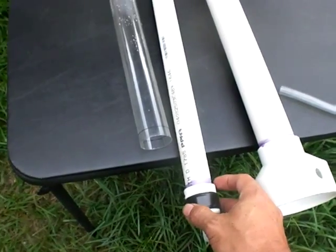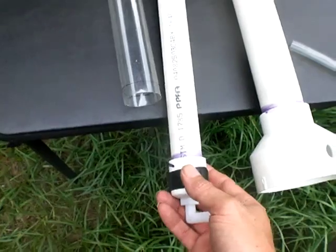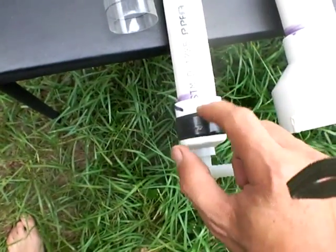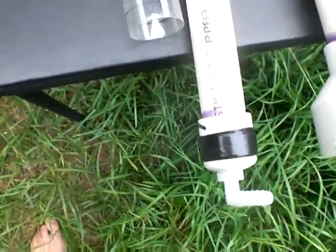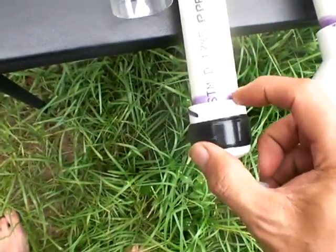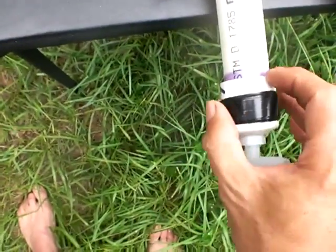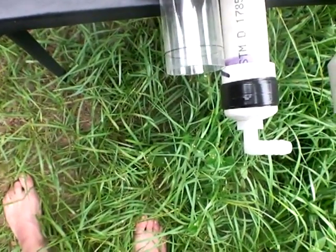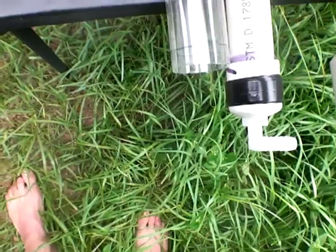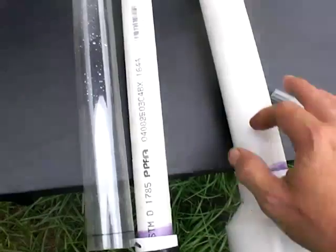I apologize for the way that ended — I wasn't able to watch the time. But what I was trying to say: when you're working on this tube, before you install this cap, you're going to want to bevel or taper the top edge in all the way around. The only purpose of that is so that when this outside tube comes down, it will self-center and come all the way down to the bottom of this tank right here.